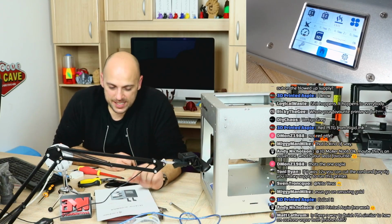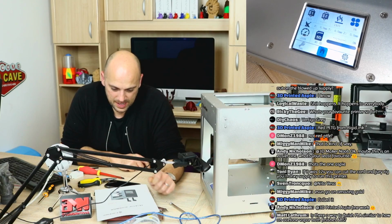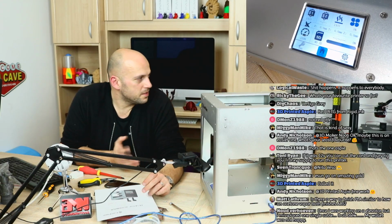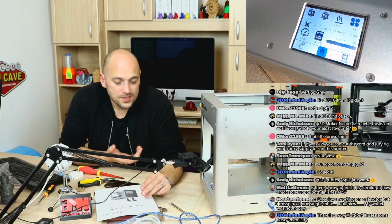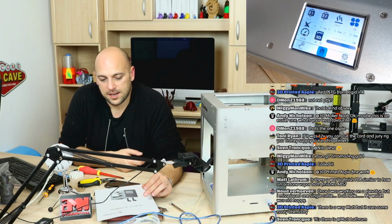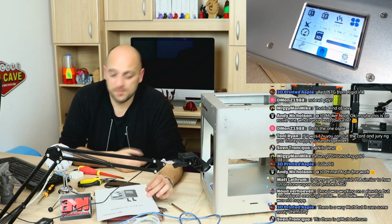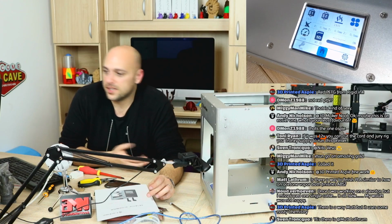It's not actually a least favorite. It's a matter of, I love the filaments. As I said, I love the bamboo fill, the cork fill, wood fills, the timber fill, all the special filaments. What I don't like about all of those filaments is the fact that they're very sensitive to clogging the nozzle, and that's a headache for me. When I was testing out absolutely all of them, I had pretty much clogs with all of them. So that is the only thing about them that I don't like, but I love the material itself.